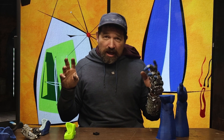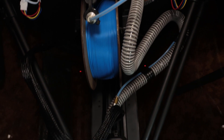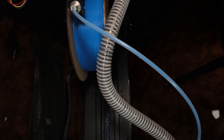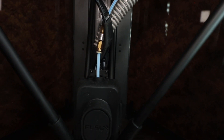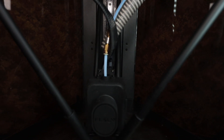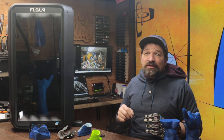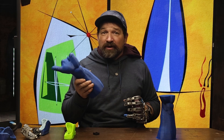What I did to remedy this was design and print a bracket that I double-sided sticky taped to the ceiling panel of the machine, centered with the spool holder and positioned about one inch away from the door. This bracket holds one end of a 21-inch long piece of PTFE tube that then connects to a coupler and into the short piece of tubing that's part of the extruder. Adding this bracket and tubing mimics the way the filament is held in the S1 Pro. For me, this modification fixed the filament binding issue with taller prints, and I was able to successfully print this 282-millimeter tall model of Chris's forearm and hand.